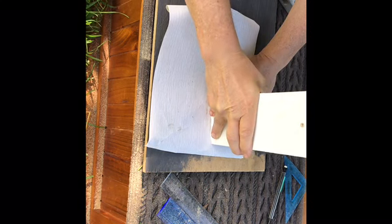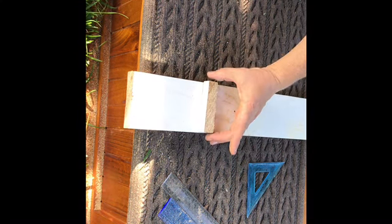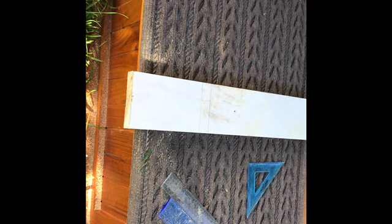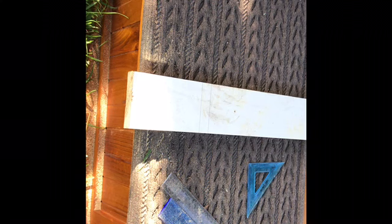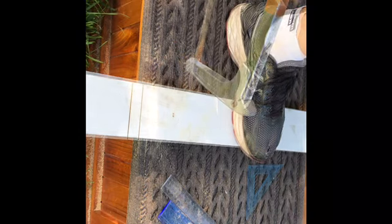A smaller piece of sandpaper would be easier. With thicker material like this chipboard, you might want to try a housing joint. I've got one line there - take a scrap of the same material and half-cover over the line to rule an extra one. That gives the right width to saw down halfway through the material and then chip out what's there. Using the hacksaw, make the grooves very close to the line at a very shallow angle, then once you get right across the top surface, level the saw down and go right across.